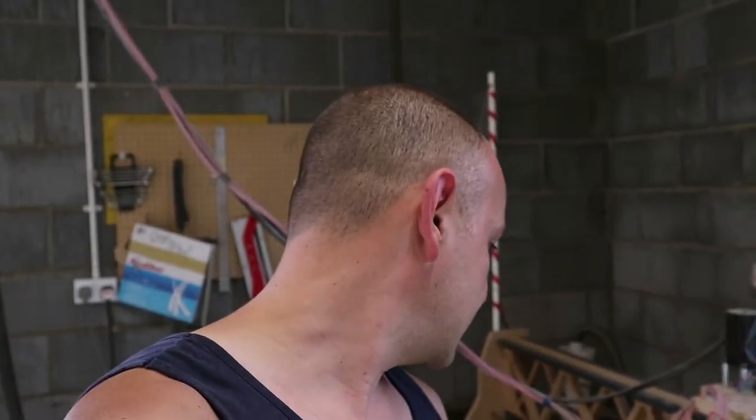But yeah, we've got some signs over there that we're going to CNC through, and so we need another way to hold it. Before, we had what's called a cam system, an L shape like that, and then you drilled a bunch of holes in the board, put some wooden dowels in, and you just cranked it round, and it just cammed onto the board and held it in place. It worked great, but for some of the softer materials like the pine, cedar, or some of the softer plywoods that we use, it was rubbish, because it would dent the edge of the board, and there was always a risk with the softer stuff that it might pop out when you're doing maybe a bit of an aggressive cut, so we don't want that.